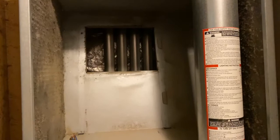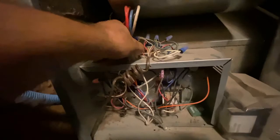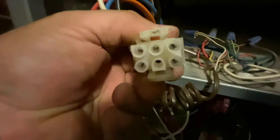It's pretty straightforward: you slide the housing in, the tabs go down into here, and then it slides in behind here, and then you return the screw. In this particular case it's just one screw — the only screw hole. I got the housing popped in here. The fins are all in and locked in place, I got the screw back up in there, and I just plugged the wire on. This is a one-directional plug — to take it off you squeeze right here. You can see two of those connectors have flat sides that correspond to flat sides in the socket so it only goes in one way.